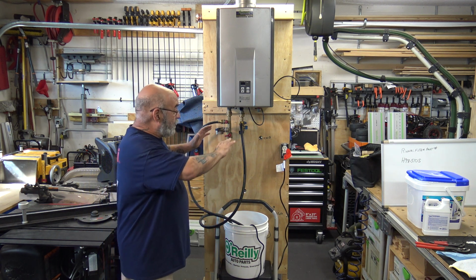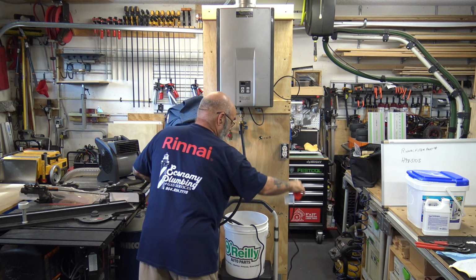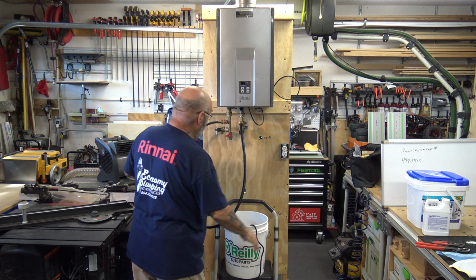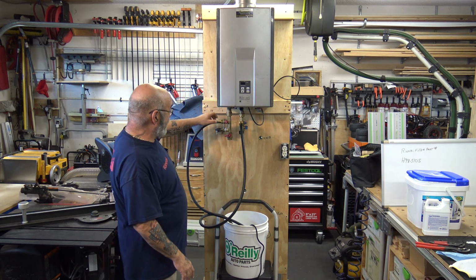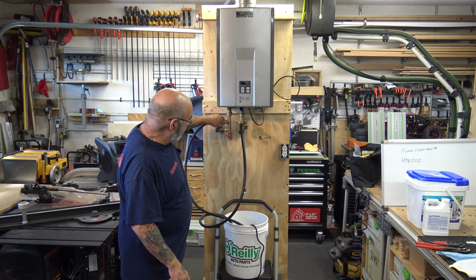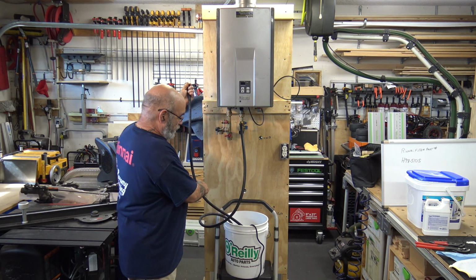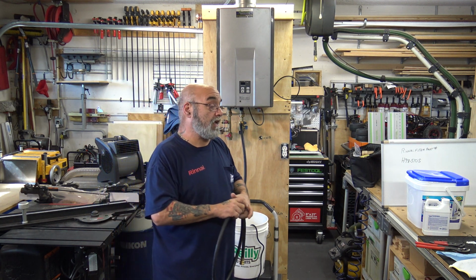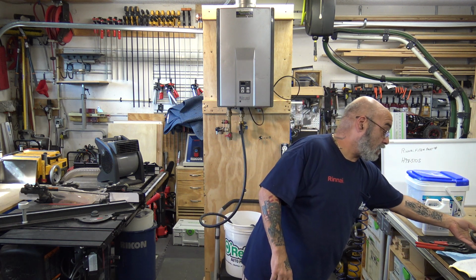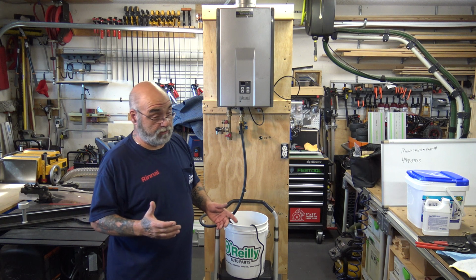Okay, so now we're done. You did your 45 minutes. You unplug your pump, okay? And once you unplug the pump, you'll actually hear water coming back in. All right, you're gonna take off your hot water line. Now, again, if it's an interior unit in a garage or inside a utility room, you're gonna need a lot more rags and a few more buckets.